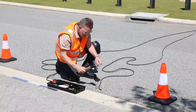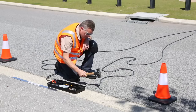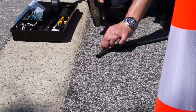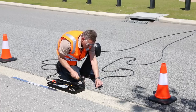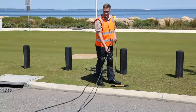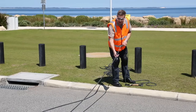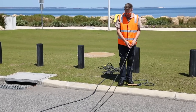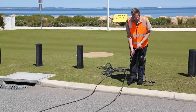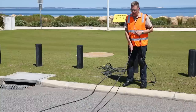Just start the nail and you're basically using the weight of your mallet to get the nail into the ground without using too much force. We don't hammer the nail completely home - we want to keep that washer a little bit loose to facilitate removing the road tube afterwards. So that's sufficient. Now we want the tube to be perpendicular to the traffic flow or the curb side. It doesn't need to be super accurate - a calibrated eyeball will be sufficient.